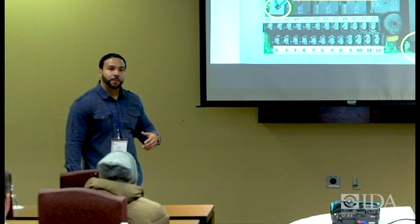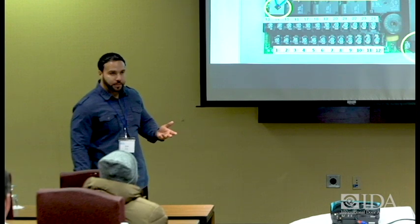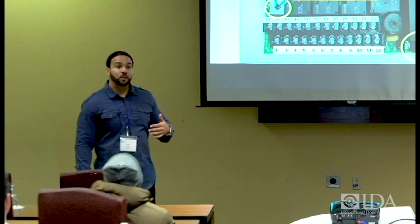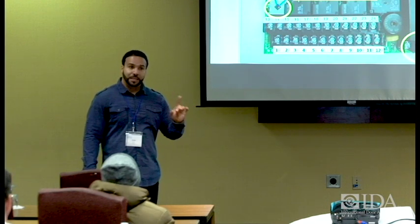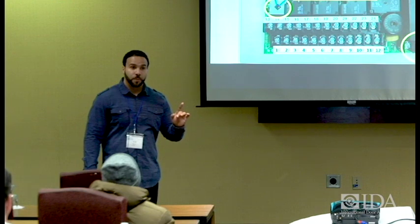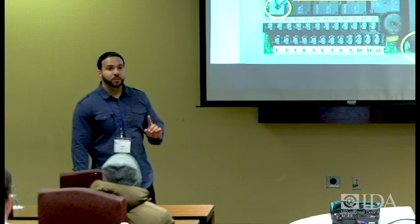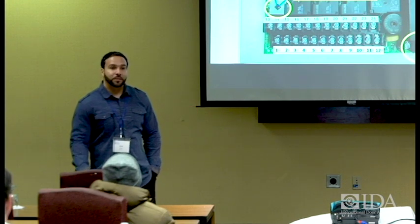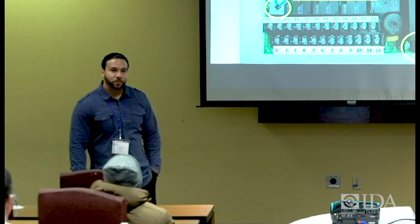And a lot of times people will not change the batteries. By the way, I told you earlier those batteries should be changed every 18 to 24 months. If you choose not to change them and they drop below the required voltage, which is 22.1 volts, it's going to start beeping. And if you don't pay attention within 24 to 48 hours, when you come the next day, the door will be closed. That's fine if it's in my warehouse and I want it closed. That's not fine if it's in the hospital. So that's what you got to look at.